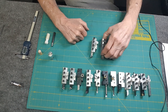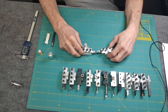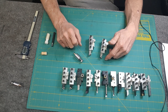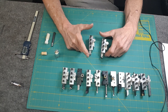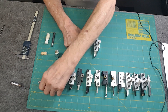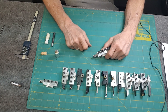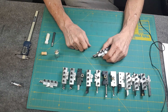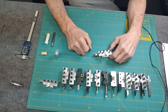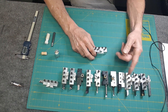Starting with the basic cutters: these are specifically for aluminum — I think these are TCMTs. I've talked about them in other videos. I can get just insane finishes with them. All of these tools, you really need to put them on rotational center. I'll show a segment on finding absolute perfect rotational center within a thousandth. Then I set these on a comparator stand and set the height. In the early days I used to fix this differently, but now I'm just using nuts and things.